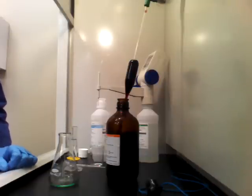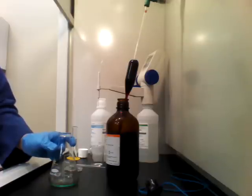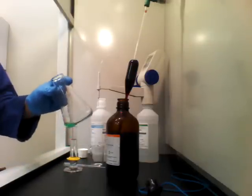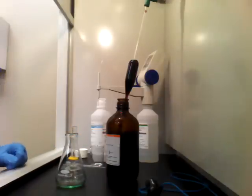In this video I'm going to explain how to test for sodium hypophosphite in an Electroless Nickel Plating Bath. The first thing I do is start out with a cooled 5mL sample of Electroless Nickel Plating Solution in a 250mL Erlenmeyer Flask.